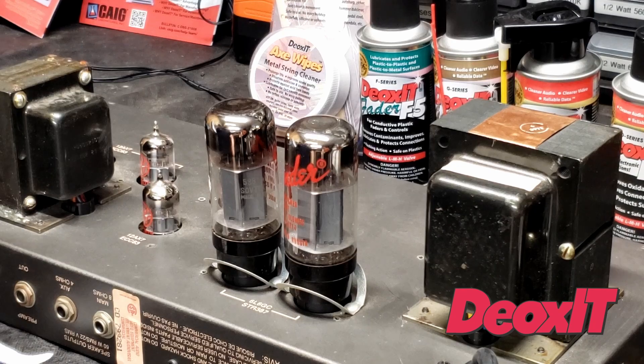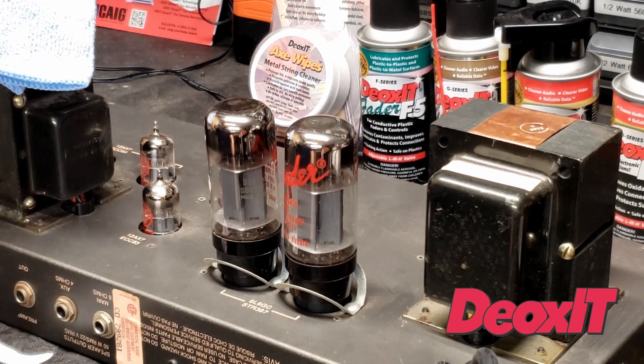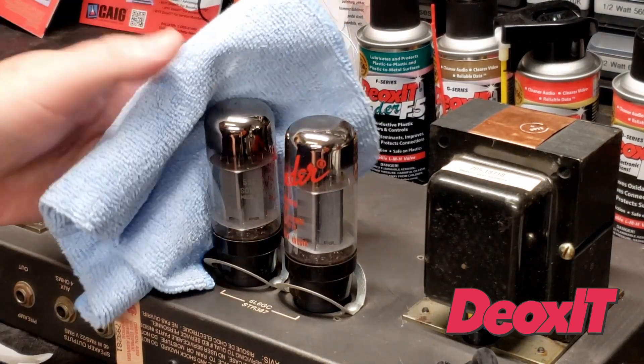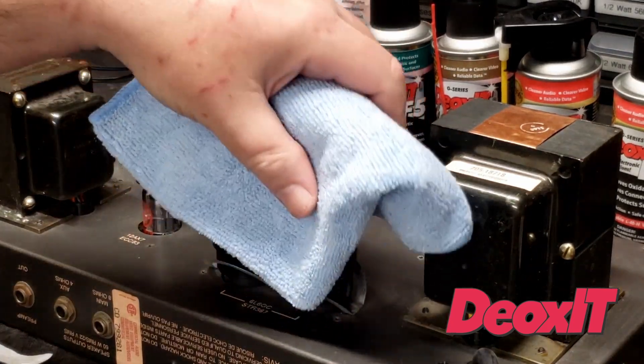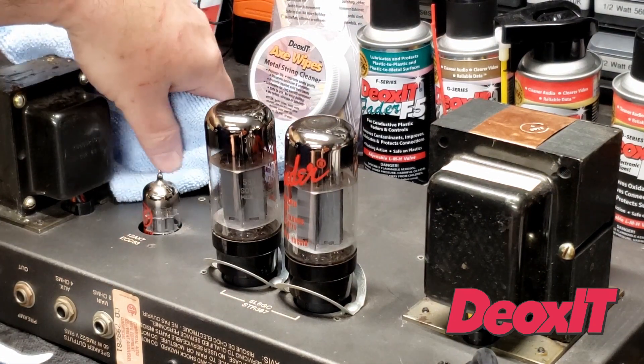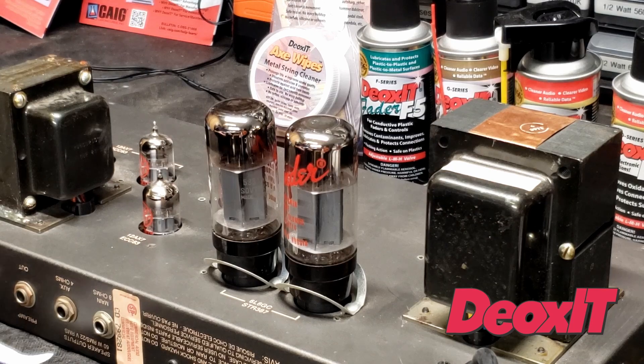Now that I'm done, a couple of things to note for good practice. If you have dust on your tubes that have been sitting for a long time, it can add to the heat when they're operating. But the kit from Deoxit includes this cloth, which is great to remove any fingerprints that may get on the glass during the time that you're handling it — and you'll have better tube life. The oils are removed so it won't compromise the integrity of the glass or the paint on the glass. In terms of practical usage, it seems like if you were to clean your tube pins and sockets once a year, you'll have better tube life and better sound when using your amp in the long run. I recommend using it once a year to clean your tubes and sockets and keep your amp in excellent health.